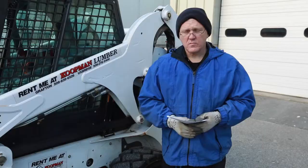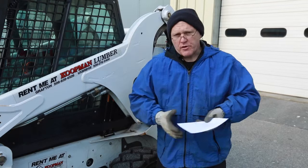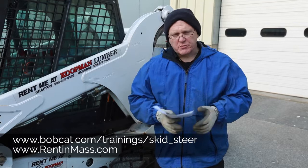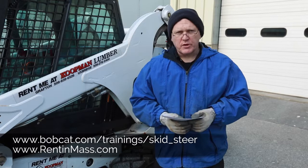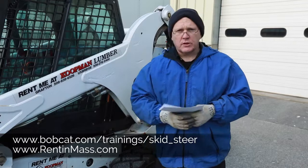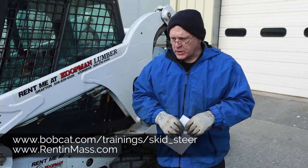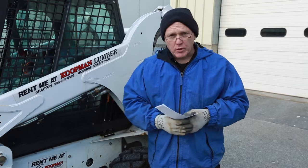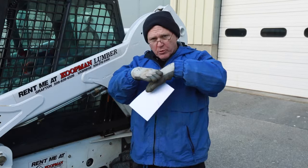These procedures are not exhaustive — for full documentation get the owner's manual, the Bobcat website, or the hoisting license information. First, keep it slow and become familiar with the machine. Don't overload the bucket; if you overload it with too many heavy rocks and try to back up quickly, you can cause the machine to tilt forward — another good reason to wear your safety belt. When running with a full load, keep that load as low as possible to the ground to keep the machine stable. Never exit the machine with the bucket raised — it must always be in the lower position. Don't allow anybody to come close with the bucket raised. Go straight up and down slopes; never go across a slope, as that's when you have the potential for rollover or tipping.